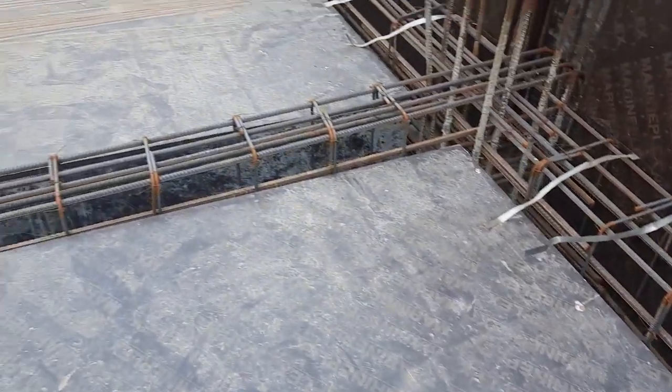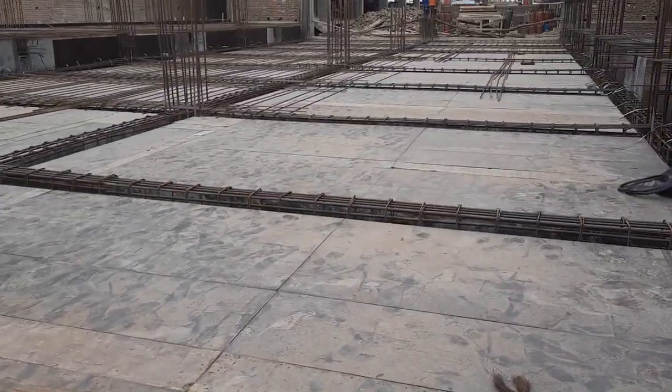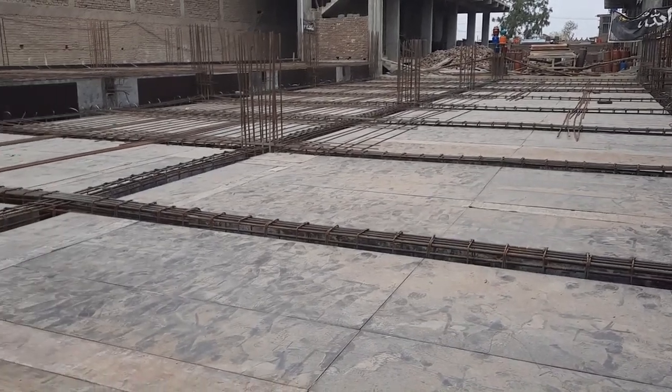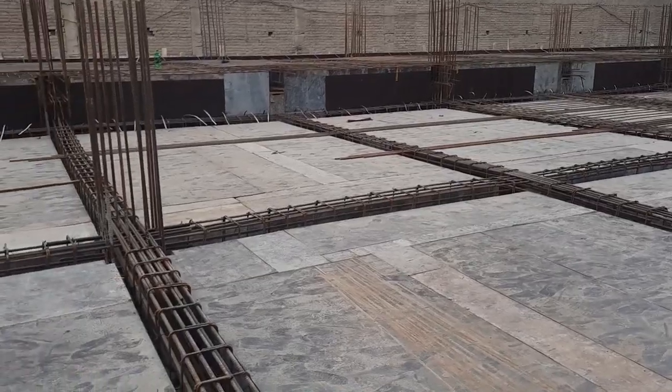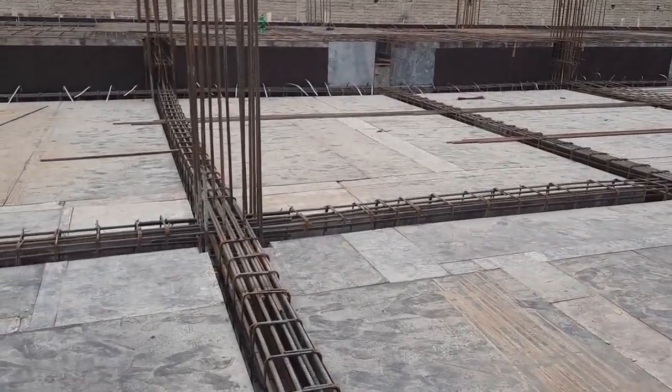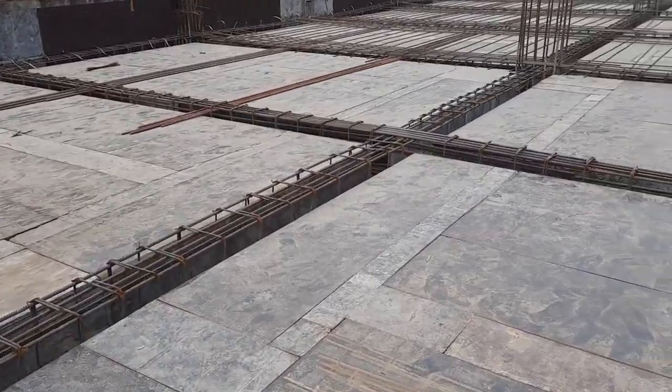You can see this junction — here they did not provide the extra rods, but they provided 10 steel rods total: four at the bottom and four at the top. After this, they will provide steel reinforcement for the slab with main bars and distribution bars.